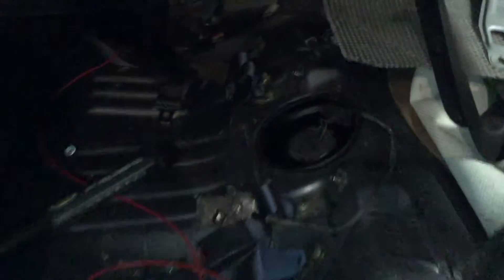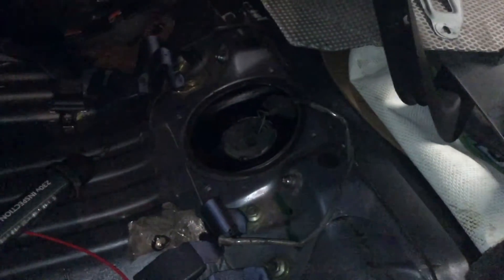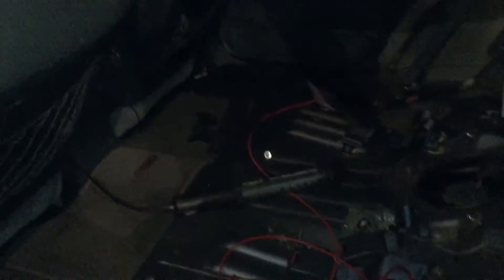I was having trouble with fueling, and the trouble I was having is obviously because, being carburetor, the engine that was in it had a mechanical fuel pump, so there was no fuel pump in the tank. The only ones that did come with a fuel pump are very difficult to get, so it's literally just the sensor for the fuel gauge that was in there.